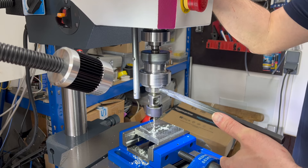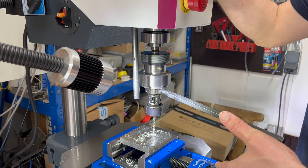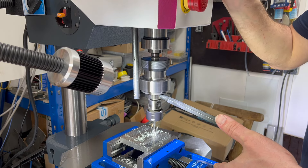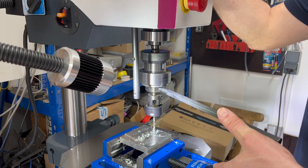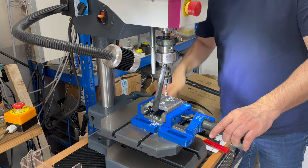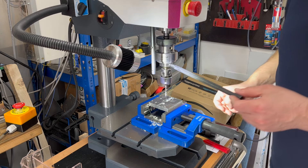That means it centers itself afterwards. One must not think that this is somehow a defect — it is the same even with expensive machines when cutting threads. But as soon as you are inside the hole, it centers itself and the wobble of the thread tap disappears. With a little practice, this thread cutting works relatively well. You quickly get a feel for how much pressure you need so that the adapter switches direction, and this way you can really cut multiple threads quickly.